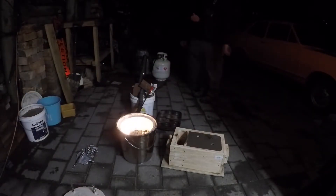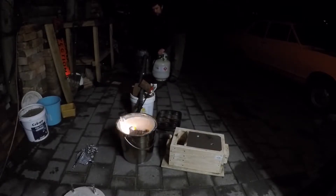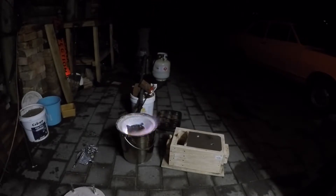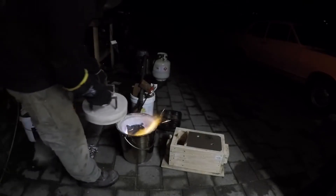That's an example of how not to light your furnace. You should really put a bit of paper in the bottom, light that, and then turn the gas on — to save you from losing your eyebrows from a big whoosh of gas. You've got to crank up the gas first, otherwise the blower will just blow the flame out of that type of burner. There are other burners out there that don't need the blower — I'm just improvising with what I've got.